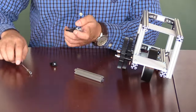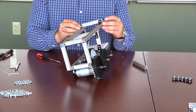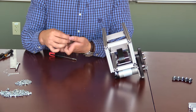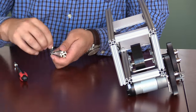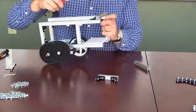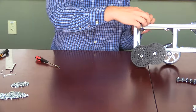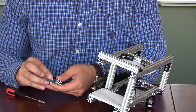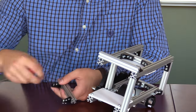For the next part of the assembly, we will need the two 10.9 cm pieces of extrusion as well as four lap brackets. We will tighten down one lap bracket so that it is flush with one end of the extrusion, then set these into the channels made on the top of the shooter. Then we will attach the second lap bracket so that this slides into the extrusion nicely. With this done, we will duplicate it for a second piece of extrusion. The first piece will be tightened down at the end of the shooter opposite the motor. The second piece will be slid freely so that it matches the same orientation as the first one from the front of the shooter back.